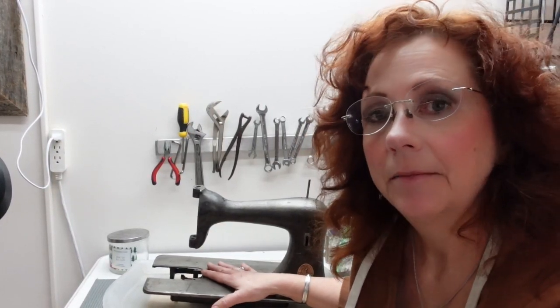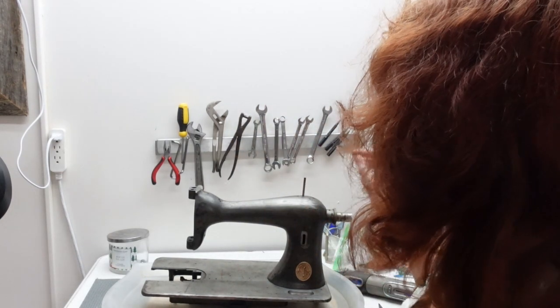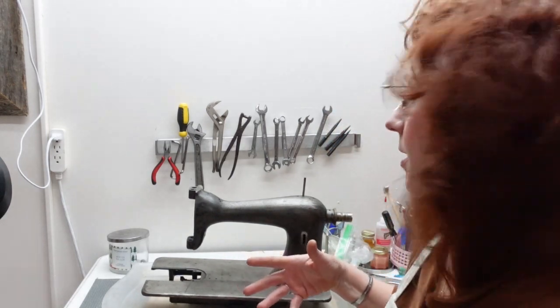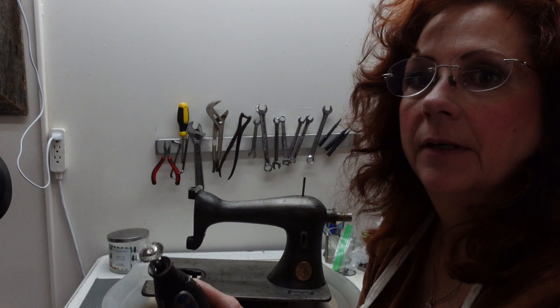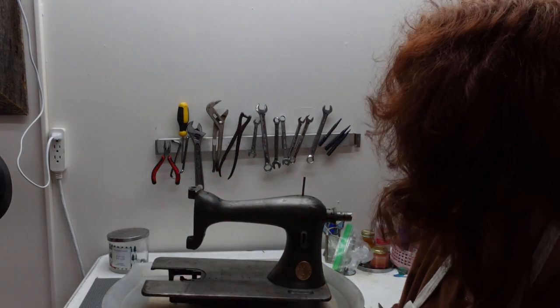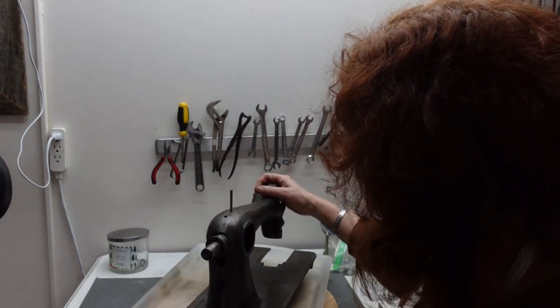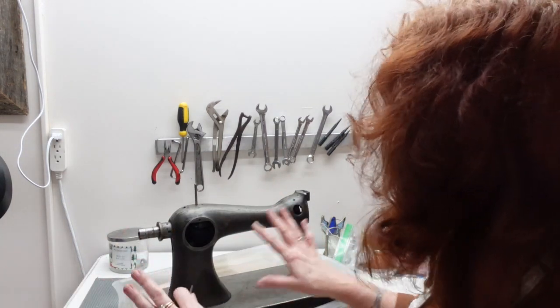This is the next day. I brought the machine in because the head part itself is pretty much stripped. There's still some stuff on the bottom that I'm not going to stress over — I am going to sand it, primer over it, so that little bit doesn't bother me. Before I get to the primering stage, let me tell you my process. There's still little bitty pieces — I'm going to do my finish work in here with my Dremel. Using a wire brush in the Dremel, I can get in and clean out all my little holes, because when I was using the stripper a whole bunch of gunk got pushed into all these little orifices. There are also some little places around the edge that I wasn't able to get to with the wire brush to clean off the paint, so I'm going to give this a really good once-over.